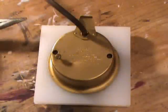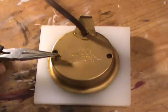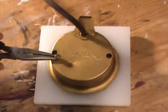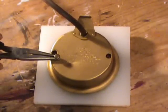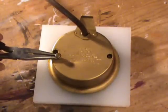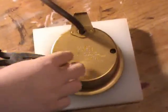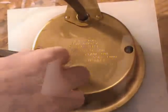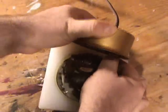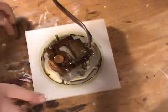You'll notice that the screws are sitting on a little spring. Once we've got the main screws out, we need to take off the little button on the back that's used for adjusting the time. Use the pliers to hold on to the pole directly underneath the screw to keep it in place while the assistant removes the little screw with his fingers, then take the white plastic off.